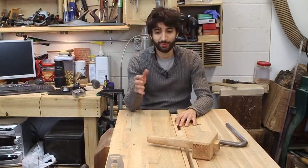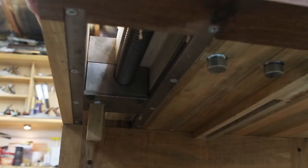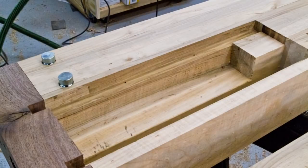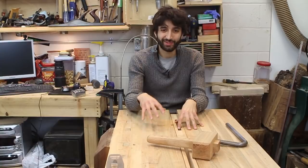The other thing going on with the front laminate is the actual tail vise installation, which is pretty complicated — at least it seems complicated when you haven't done it before. There are rails underneath that need to be recessed into the bottom of the bench, and you need to create a channel for the mobile dog block to go back and forth in. There's a lot of work involved. The unfortunate thing about making a bench like this is you don't really do it more than once, so although I could do it faster a second time, I'll probably never have to.